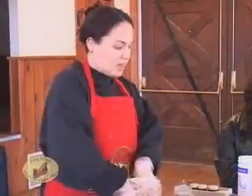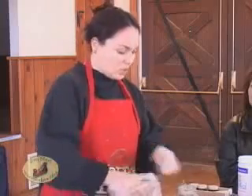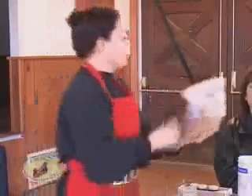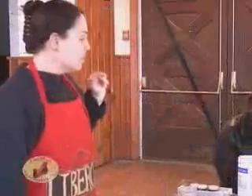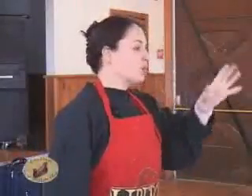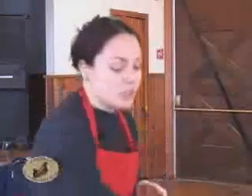When I had a lecture, someone asked a good question of how to measure shellac if you don't have a scale — there are these pound cuts. I'm going to put a little bit in and pass this around. Just look at it, smell it. This is orange shellac. There are about five different colors: the least refined is seedlac, which has little bits of twigs. Then there's buttonlac, which is darker. There's ruby, orange, blonde, and white. As you get lighter, it's more refined and more fragile — it's been bleached and stripped.